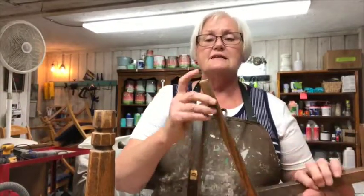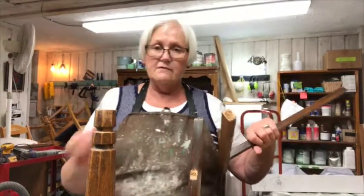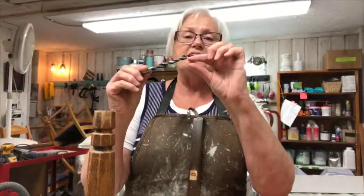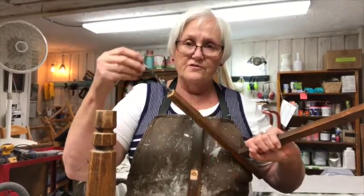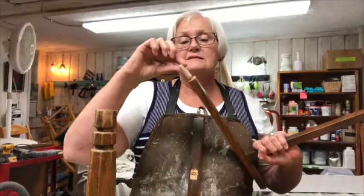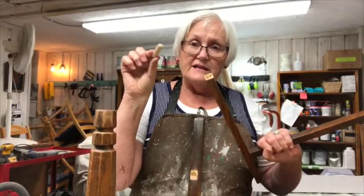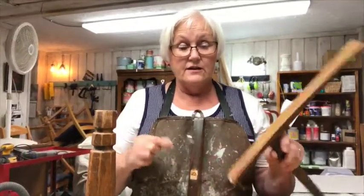That's going to be good because the next thing I have to do to fix this is to drill a hole that size. I have my handy little drill bit — those are the ones for drilling good holes for your dowels — and then I have these little dowels that are the exact size we need. So I'm going to put new dowels in here to replace the old ones.